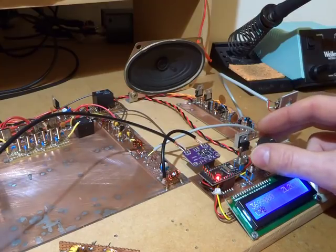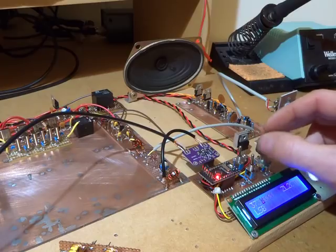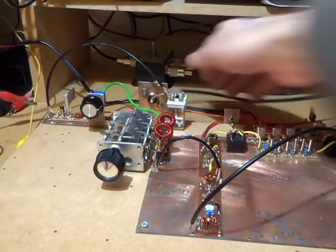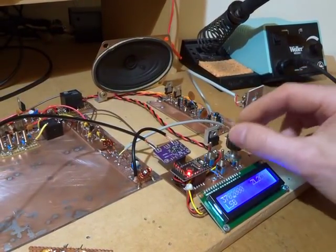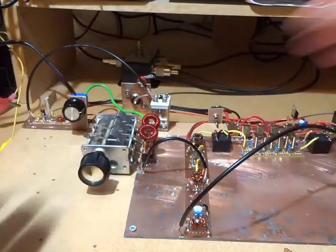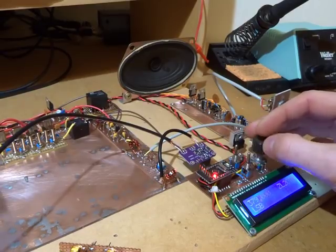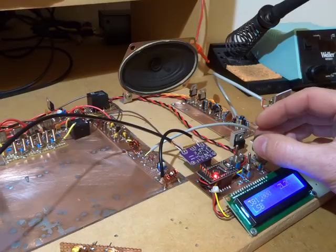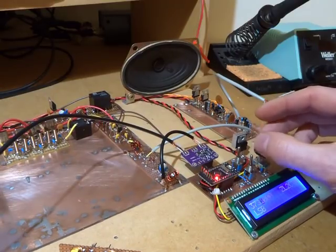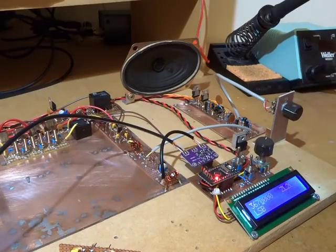Alright, let's see what else is back on SSB. Now, for interest's sake, that noise is all atmospheric. If I pull the antenna connection off, gone. So that's volume 4 there. That's just so, so noisy. We'll put that antenna back on again. What's that atmospheric noise there? In digital mode. So 3670.